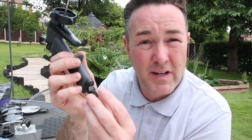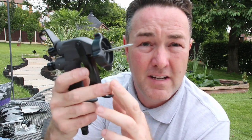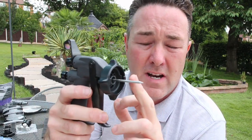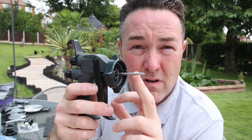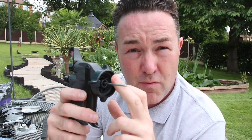You're going to say, what do you mean, Phil, quick release? We know about quick releases on hoses. It's not that. It's the quick release feature of the needle on the end and the spray tips. Now I'll come on to that in a minute, but I'll just briefly tell you what it is. Now you've got a needle there, can you see? It's already set up in the gun. Now the needle is universal, and when I mean universal, it can be swapped between the spray tips.